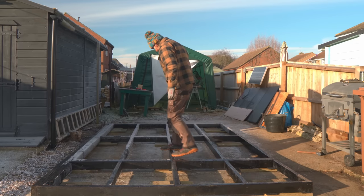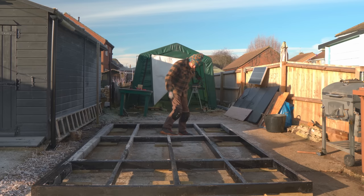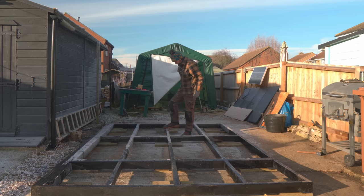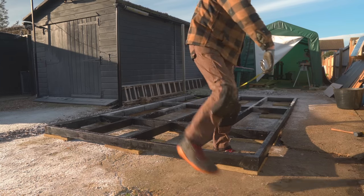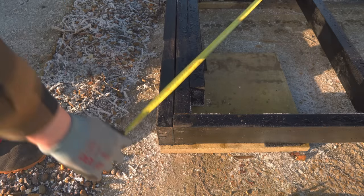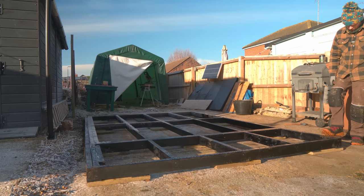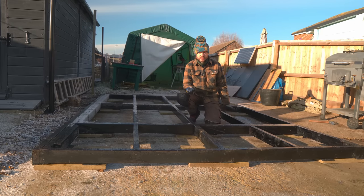This all seems really nicely supported with no flex in it, but before I can get the sheets on I need to do two things. I need to check that it's all square and wait for this frost to melt because I don't want to trap that under there. The sun's out now so I'm going to get the tape and go from corner to corner, check square, and just knock it around until I get it perfect. That's all square. The next job is to get some sheets of OSB on — they're square themselves so they will help pull anything square and keep it there. I'm just going to wait for this to dry off and go inside and have a cup of tea.